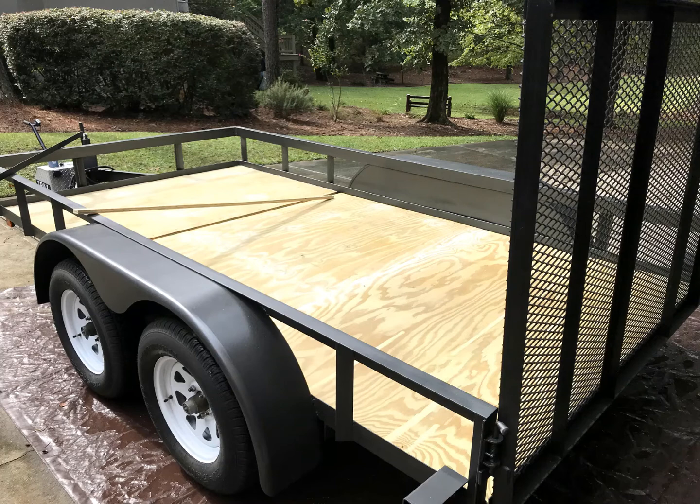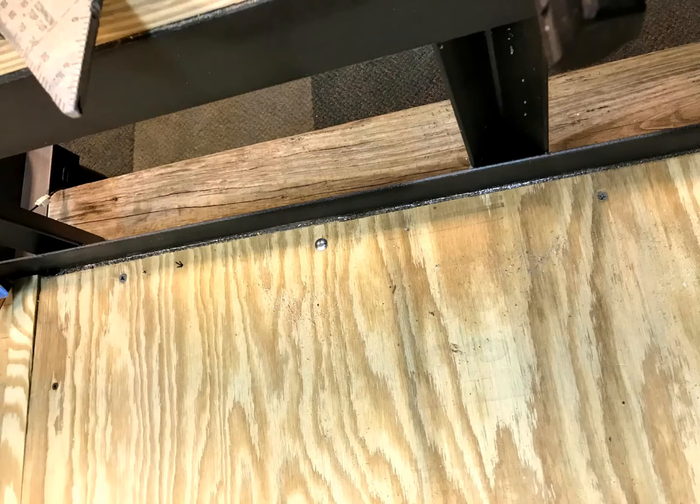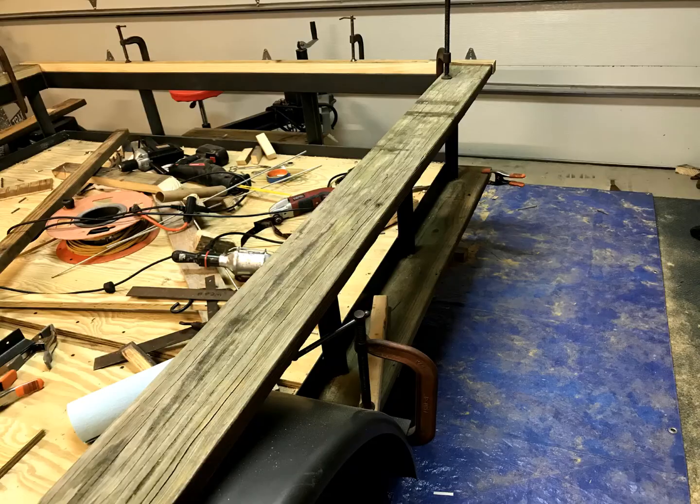I used 3/4-inch ground contact pressure-treated plywood for flooring. That gave me a little more headroom than the former 2x8 boards. The flooring had been glued, screwed, and sealed with silicone around all the edges. I still planned to have the Jeep run up on 2x6s to distribute the wheel weight over the length of the trailer. I widened the trailer by about a foot without changing any steel so as not to affect the structural integrity of the trailer.